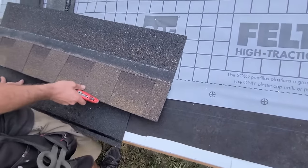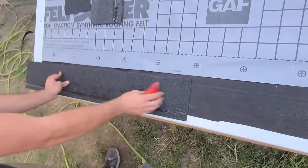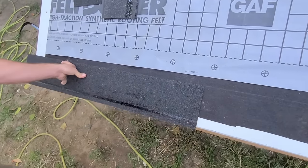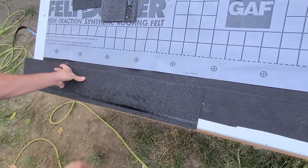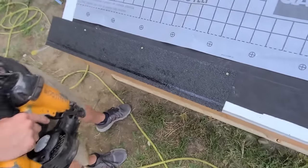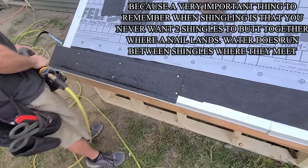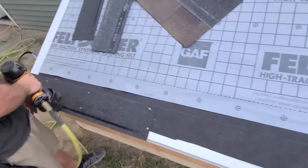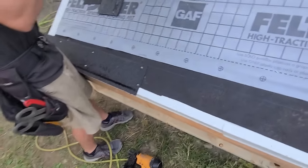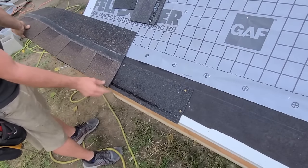What I would recommend, if that's happening, is to start with a stagger where your shingle is going to be hanging over, so that it gains back towards this way. You're gonna have to watch your nails. I know there's not gonna be a nail anywhere on this piece, so I can nail super low. You can pack them here or do whatever you want, so that when you put your shingle up, you don't eventually have it landing like this — because that's a problem.